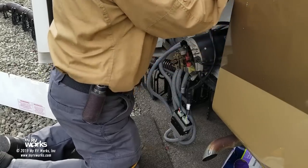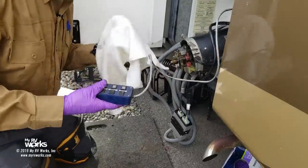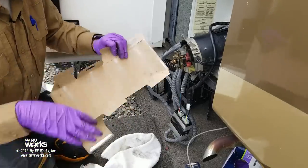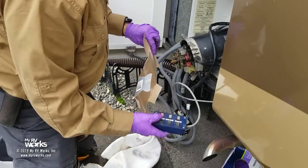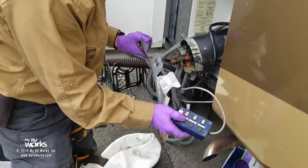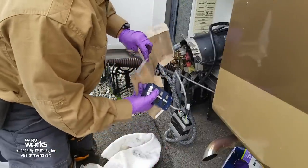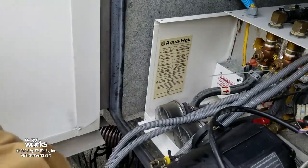I'm going to hold a towel here and I want to see the spray pattern on my cardboard box. I've just turned the burner on. You're going to hear it click — keep an eye on that nozzle and how the fuel is coming out. You'll also see the spark as it tries to ignite, but I've got my thumb on the off switch. See that spray pattern? It's coming out terrible — it's not a fine mist, it's kind of like a stream.